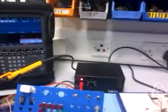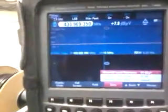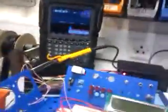So now the new solution is that when the sensor is triggered, the transmitter is turned on through a series of NOT gates, from the activation of the sensor, so we see no activity on the spectrum, and as soon as I put my hand over the sensor here, I'm going to try and show you, activity. Therefore, all transmissions can happen, and there's no blocking of the frequency.